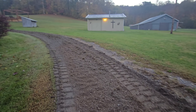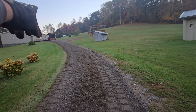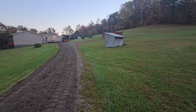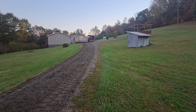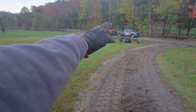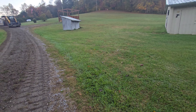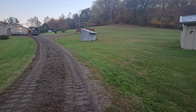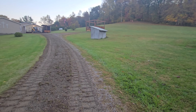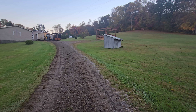Just to fill you in a little more on what's going on here — we've got a lot of water coming down this way and water coming down over here. One of the things we've got to fix is how this water is going to be coming across this driveway. The owner said they put a French drain in here. He said it helped a little but didn't really fix the problem, and that's always true. French drains do not work for moving water, so please don't spend your time using that as a solution.